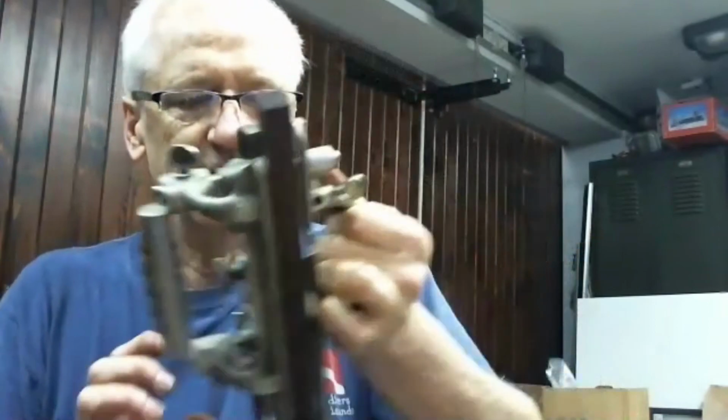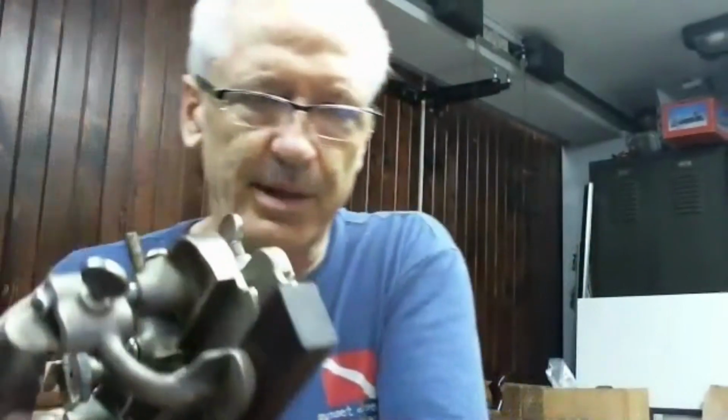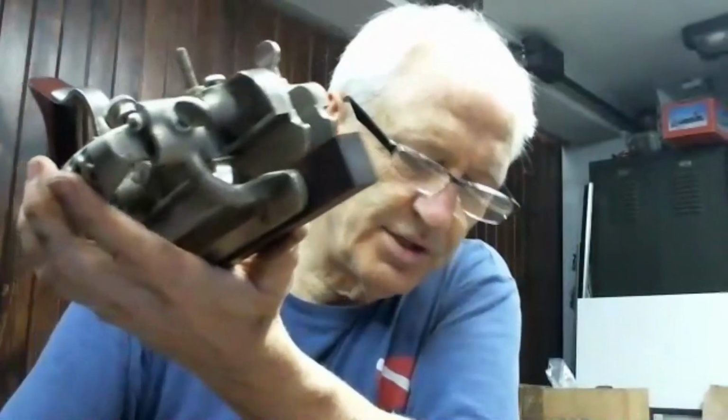Doesn't do a lot of good to make a video showing you using a combination plane if I don't show you some of the setup. So I'm using a Fulton 5389. That is a Sargent 1080 combination plane. It's Sargent's version of the Stanley 45. They're very similar. The blade engagement mechanism is different.